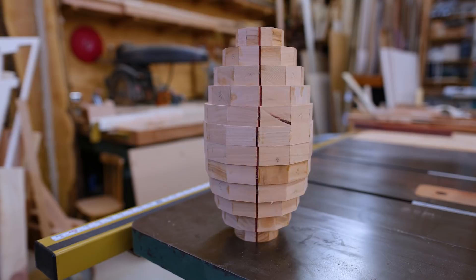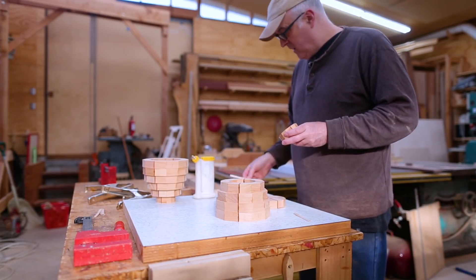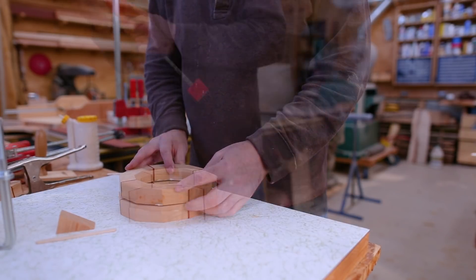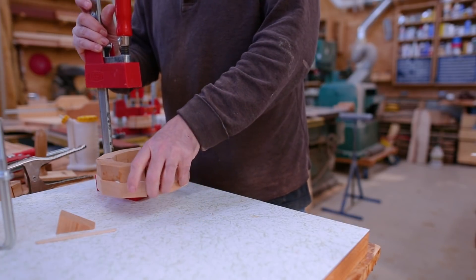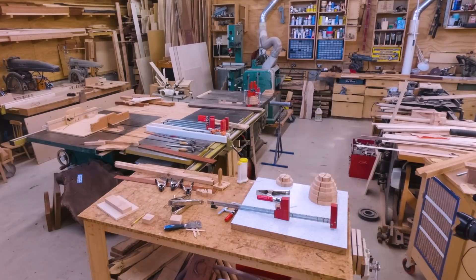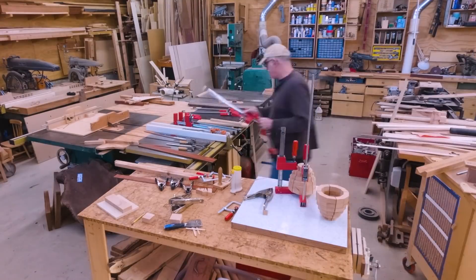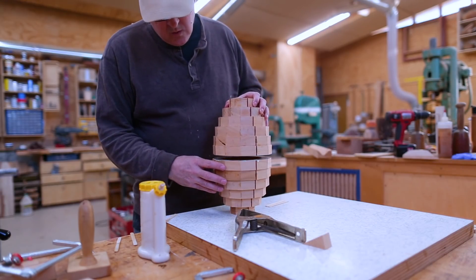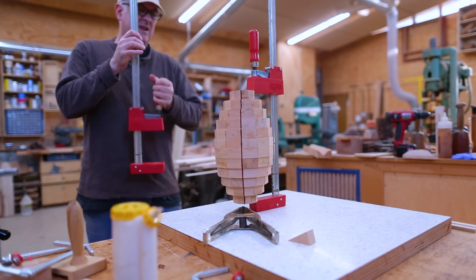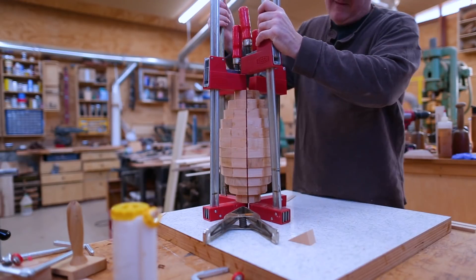I can sand each side of each ring to get them ready to go together — this is how they stack up. In gluing this up, I was concerned with the seam between the rings but also with getting the darker thin seam pieces to line up so they would read as a continuous line on the finished football. The other way to do these seams would have been to glue up the entire form without the dark pieces, then cut it into four quadrants and glue the seams in as one continuous piece. Doing it my way meant the rings weren't staggered like a brick pattern, making a grid. I glued them in pairs, then joined pairs, then brought the two halves together — one seam at a time.